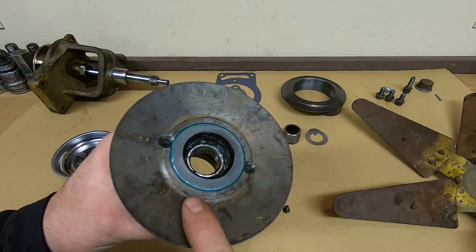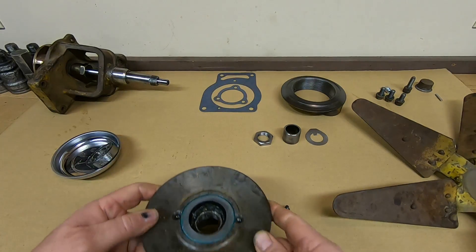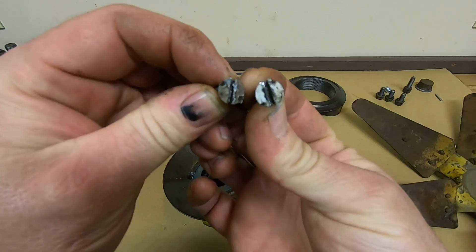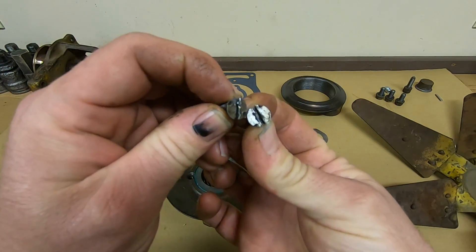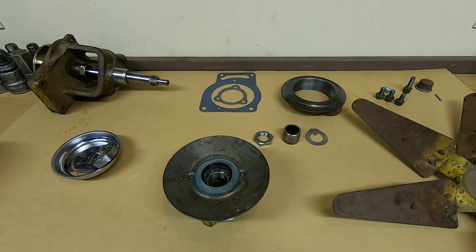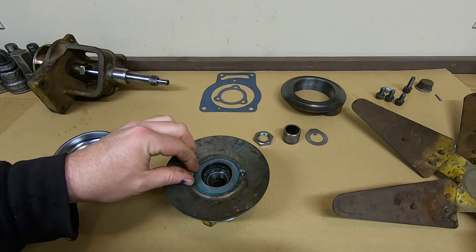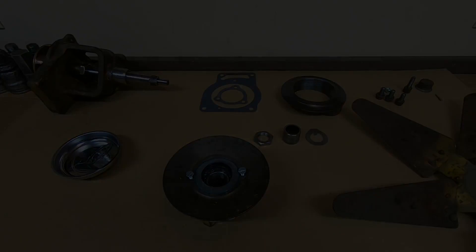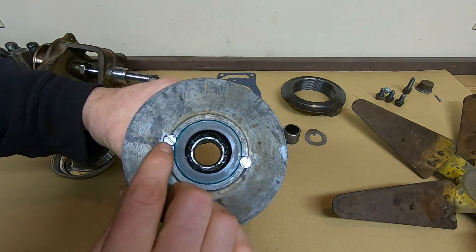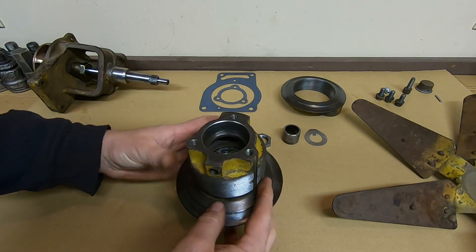Sticking true with the original design, I'll put a couple of machine screws in to back the seal up. Even though they were deemed not necessary in later tractors, they do stake the heads — the beer can engine had the same screws with the same staking marks. These get pretty beat up so they can't be reused, but they're just standard machine screws with a screwdriver slot. Dropped in a couple of new ones, cinched them down, and replicated the factory staking marks in all the same spots. That finishes up the back side.